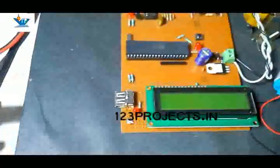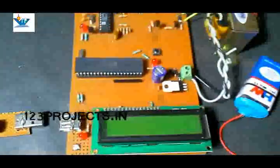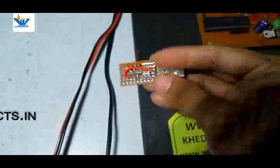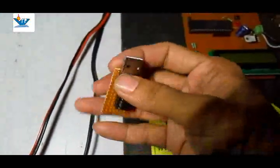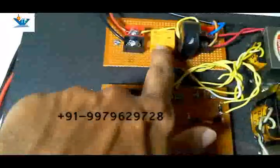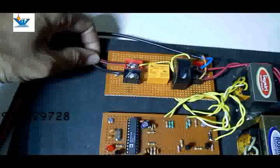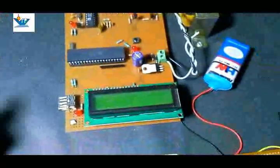If we do not have a sufficient amount, or we remove the smart card from the socket, or there is any problem such as a corrupted smart card, or someone tries another smart card, the authority code will not be available in that fake card. So the chip will not activate the relay and we will not get power at the output terminal. This is also called a hex switch, which we have built into this unit.